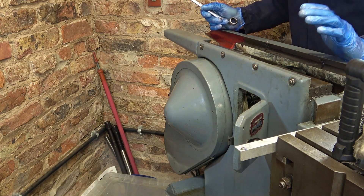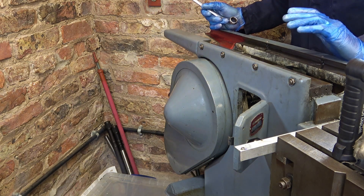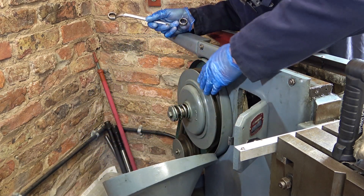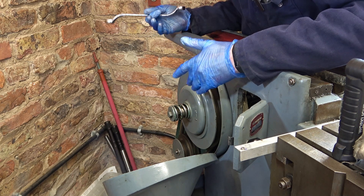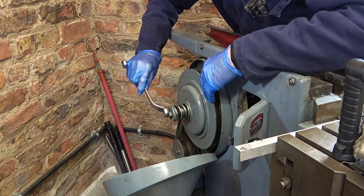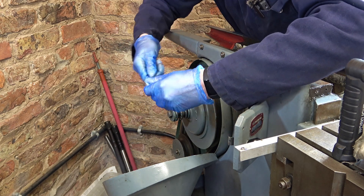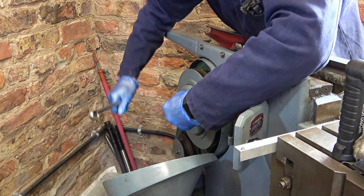Next day - I've thought about this overnight. I'm putting quite a bit of work into it and I think we'll make some quite important improvements. It's worth the bit of work to check the bearings on this big pulley here. If I don't do it now, I'm sure in the future I'll listen to it grumbling and regret it. So we'll get the clutch off - that's three quarter, 19 mil - releasing this spring here on the clutch.